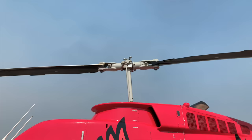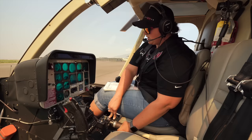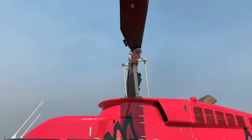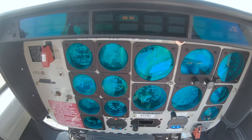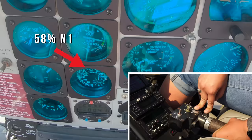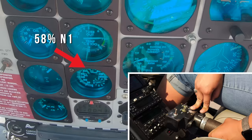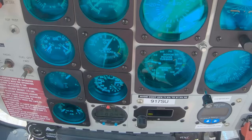Now I'm watching TOT — two spikes. It slows down around 500, then continues to 700. I want to keep it in the yellow, so I'm going to roll on a little more right there. Slowly moving the throttle, keeping it in the yellow arc. As I'm keeping the TOT in the yellow arc, I'm also watching the N1, waiting for it to get to 58%. Right there — I have 58% off the starter at 50 seconds.